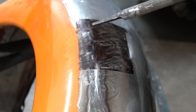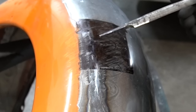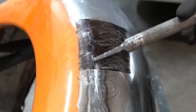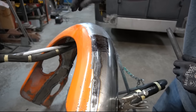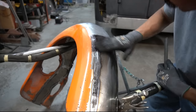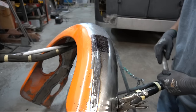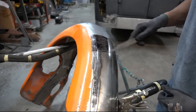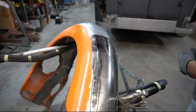There are little high spots right here. So what I'm gonna start doing is hammering with a slapper in these low spots to bring them up. I can tell with the shine and the light shining down — I can do a little dance and see where the light's shining — I can pretty much tell what's high and low from the reflection of the marker. So let me go ahead and hammer some of these out, then we'll file it again and see where the highs and lows are after that.